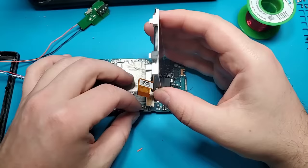Zune's charging port. The red wire from pin 1 gets connected to the voltage pin on the wireless charger. The black wire from pin 24 gets connected to the ground pad on the wireless charger. The additional grounding point shown here is connected to the grounding point on the voltage regulator.